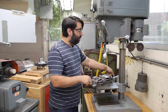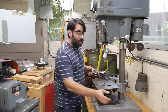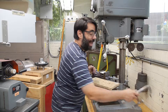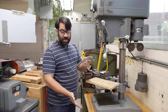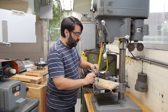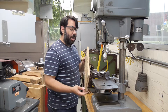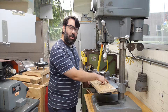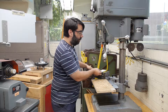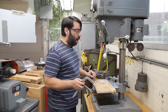The next method for holding parts, if the vise is not suitable, is to simply rotate the vise out of your way. And if you have a larger piece, you could clamp it directly to the table on the machine. We always have an array of clamps directly underneath the drill press table for this purpose. We can position the part and use an assortment of two or three of these clamps to clamp our workpiece to the table. We also have sacrificial boards used to protect the table from the possibility of hitting it with a drill bit. So quite often we'll sandwich the sacrificial board in between our workpiece and the table, and then use the clamps to secure the part.